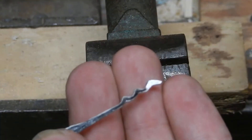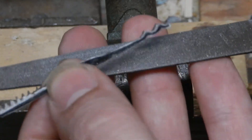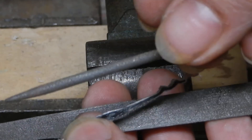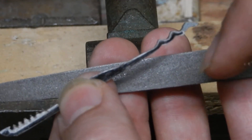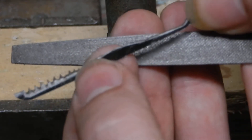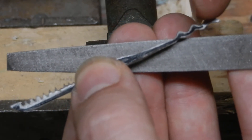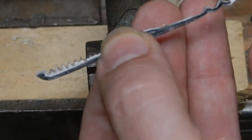After I've cut in all of these little bits, it makes it a lot easier to come in with a file. For me, a combination of a flat file and a small round file really lets me get in there. I just keep trying to get closer and closer to the black outline. I just super glued on this template that he had. I'm still a little oversized, but I'm leaving a bit of that for when I sand and polish this down.